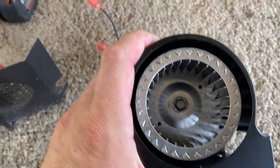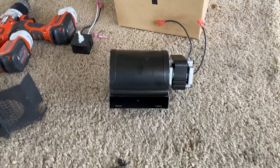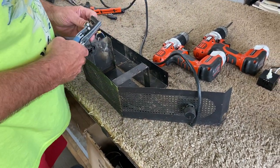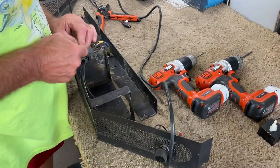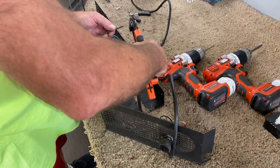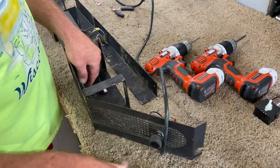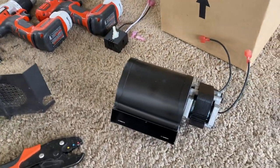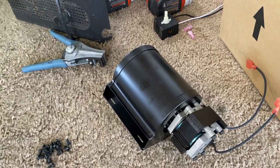You'll see these nice new blowers we're going to put in. Jim's put two wires on. Really nice ball bearings and metal wheels — they're actually properly seated to the shaft, so you're not going to get distortion. These things are really well balanced. When we get a blower kit from a customer, we bench test it first to confirm all the problems. In this particular one, the blowers were very off-balance and the wheels were a little misaligned, causing resonation in the motors and a loud blower assembly. These new ones are really finely tuned and super well-balanced.